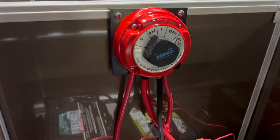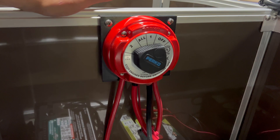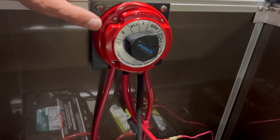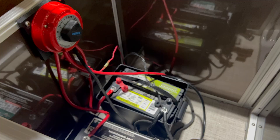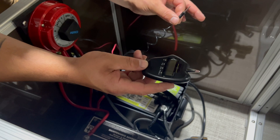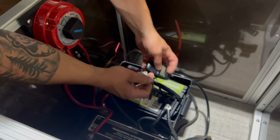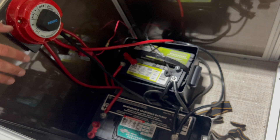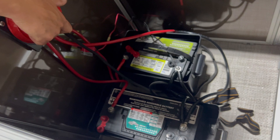That's how I run my switch. When I get back to the dock, it goes to off. I run my boat all season and never have to charge my batteries season in and out — they stay topped off using this system. Now I'm going to use a simple voltmeter to show how much voltage the batteries are putting out. Both batteries are currently reading 12.7 volts. I'll turn on all the accessories and we'll see how much draw is taken from each battery.